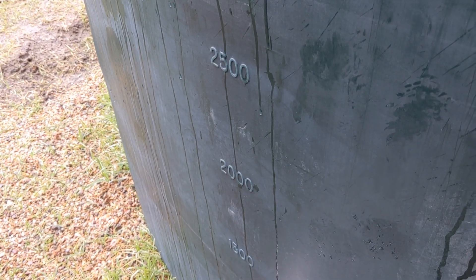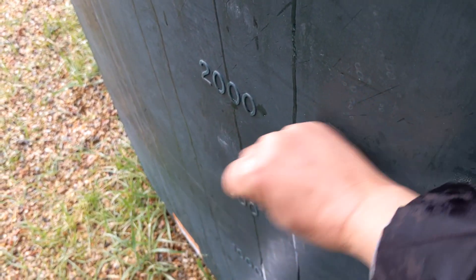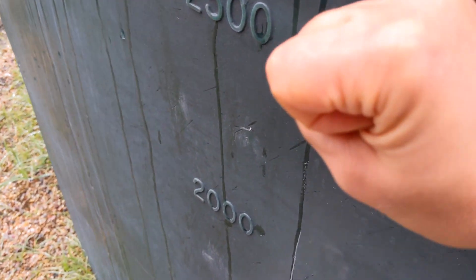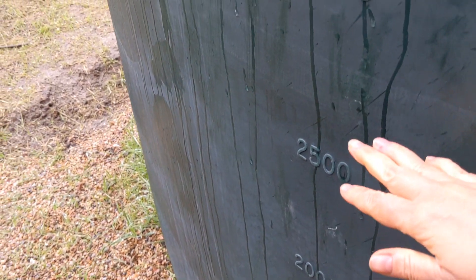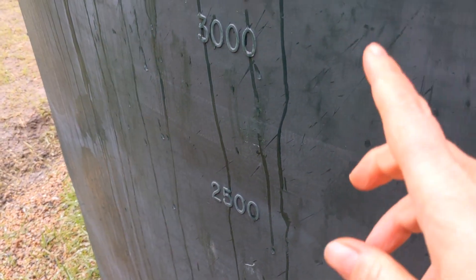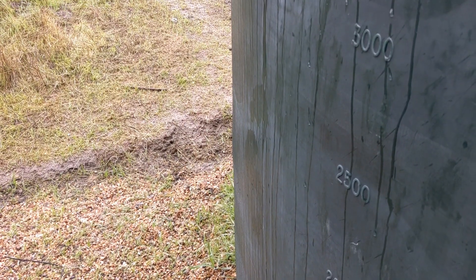You should put your sound on maximum right now to hear the difference. Right here is a very dull sound — water is there. And here it's a more shallow sound, so we don't have water here yet. Let's find our border line. Still shallow at 3,000 gallons... and it's dull here. So our water level right now is roughly between 2,500 and 3,000 gallons. That's the collection we had from three rain systems — which is perfect.